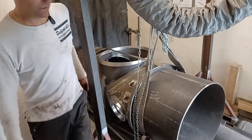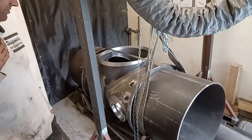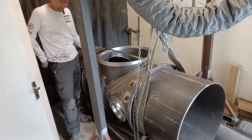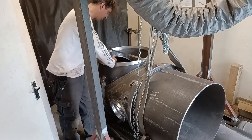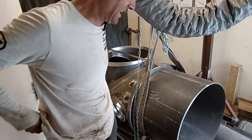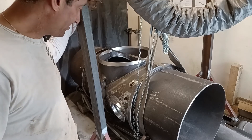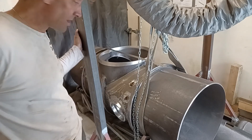I'm going to drill — there's one to go there and the same on the back, which is for the main ballast tank vents. I've got the vents for the variable tank to go in, and the fill vents for the variable tank. The biggest one I'm not sure about is the one for the motors, because I haven't decided what motors I'm going to get yet. There's quite a lot of movement on motor progress, so I'm waiting to see what I think is the best idea.